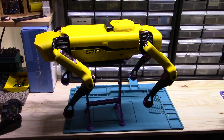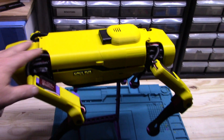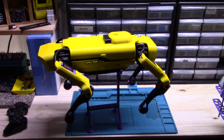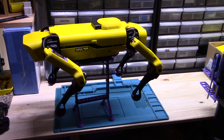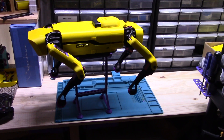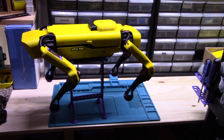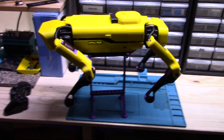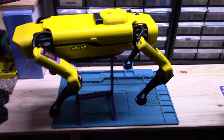My next step is to play around with some walking gaits. I did put her on the ground and try out a couple of walking gaits I had worked on, but no go — she's still dragging her butt. I'm pretty sure that's because I programmed the walking gaits for a much different Nova. She still may be back-heavy, but I have room to move the battery around a bit and even weight the front if I have to.